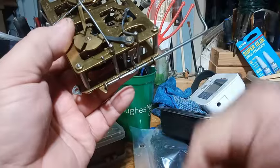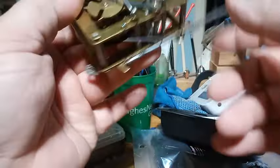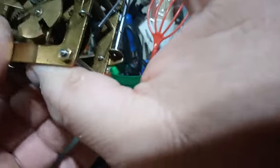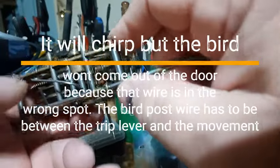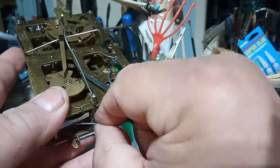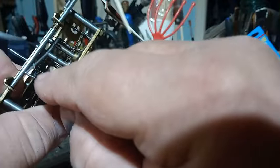It's all one unit. But if this bird post wire is on the opposite side, and if you've got this thing connected to the door, it will sit there and quail all day long — possibly. Because it has to be underneath this trip wire. That way that spring can, when pulled, bring this lever down into the count wheel. Same way on the cuckoo side — this bird post wire has to be in between the trip wire and the plate.